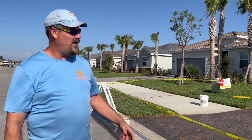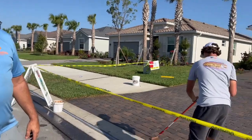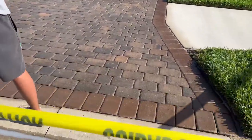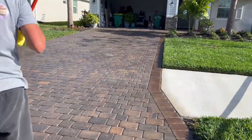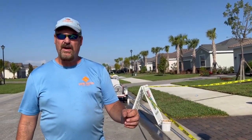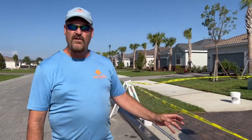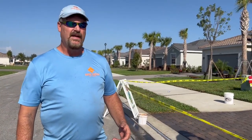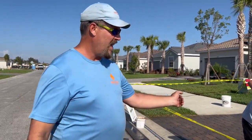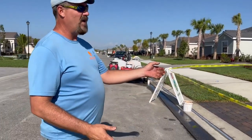We started off this morning, cleaned it, and dried it. As you've seen in an earlier film, we flood coated in some water. Then Orca mixed with a little bit of bronze — or brown, I call it — it's called brownstone. I put basically two capfuls of brownstone into a half kit. After I sprayed the first coat, a good flood coat, I came back and did a second coat, same color, two capfuls to a half kit, and went the opposite direction of the first coating.